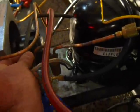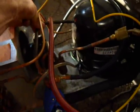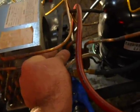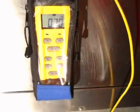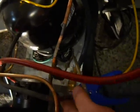But I don't have my, these are critical charge cap tube systems, and the suction line temp is cool. See what the temp is on here. I wonder why my gauge ain't working. Reading 70 degrees. I don't believe that. That suction line's colder than that. So, anyways, gotta see what's up.